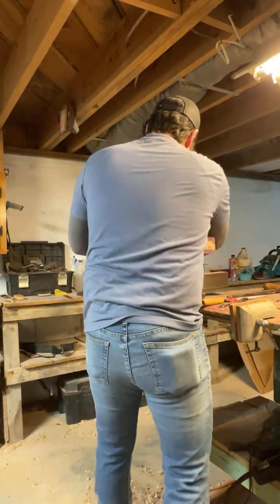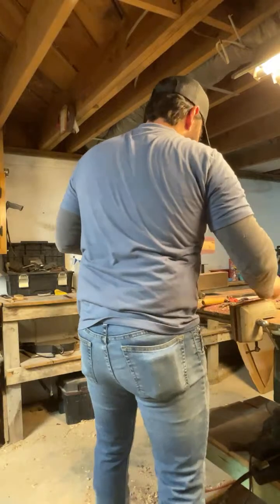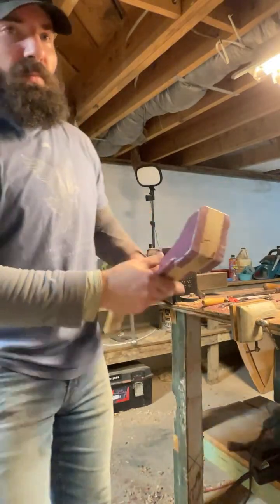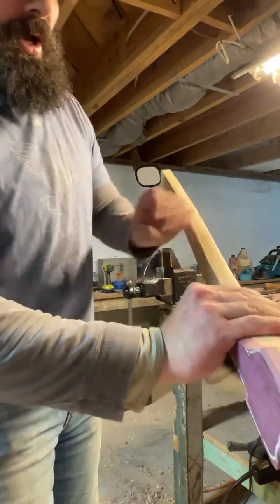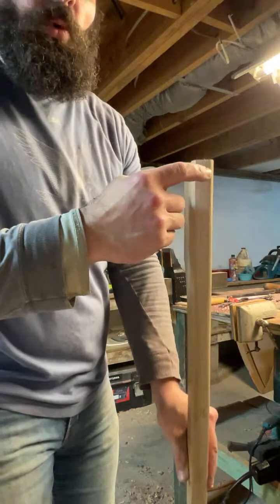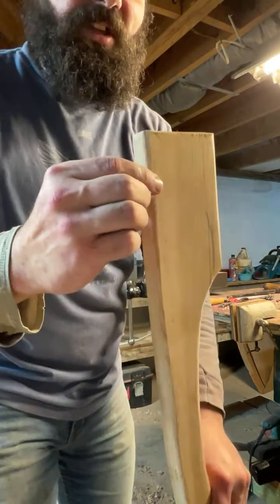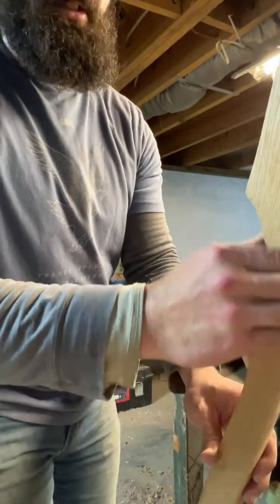Something that helped me kind of understand a little bit more about wood was thinking of it kind of like a straw, you know, like you've got a stack of straws like this, and the wood grain either goes, reading the wood grain, right? Here it is. So follow it up and through the axe handle. And you want a wood grain that goes from here all the way down. And you can see, look at this. See that? Well, you can see it end, comes out. So that's called run out.